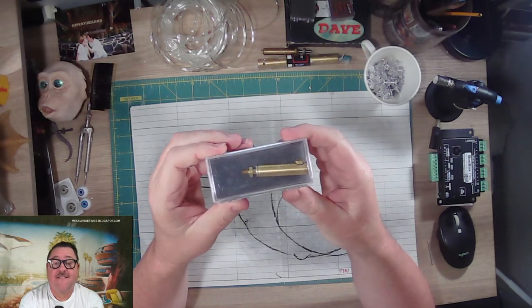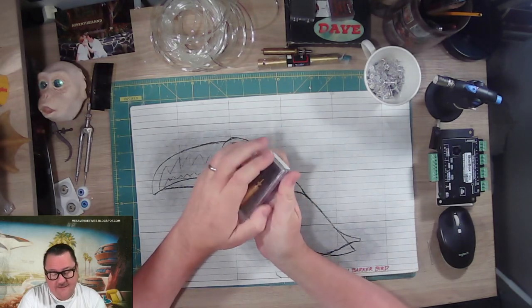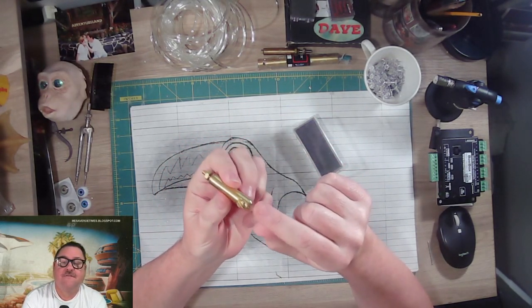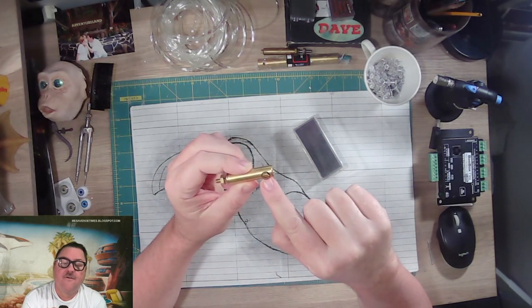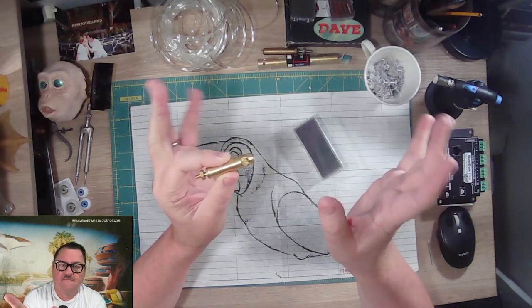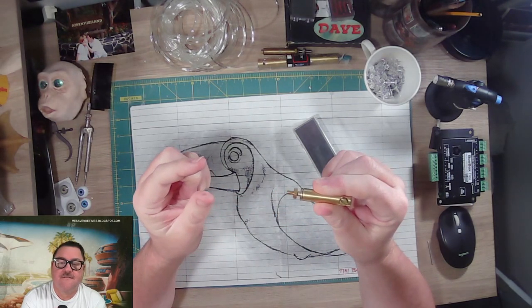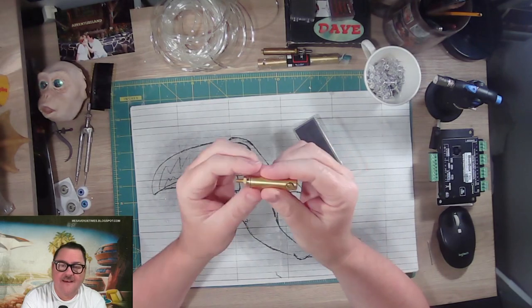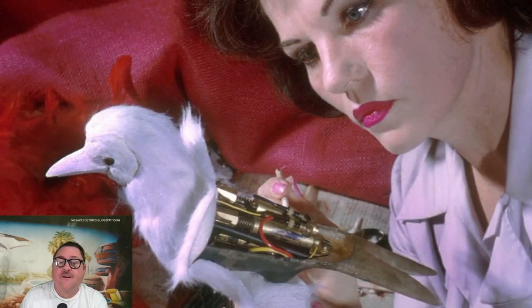This is one of the brass cylinders we were just talking about, and they're still made today — like Clippard Pneumatics. They come in a handsome little box. Basically you have two ports where you can put your air fitting — the hose goes in on the back — and the air goes in, the cylinder extends, the air goes out and it springs back in. It's a single-action cylinder. That's what you see in the pictures, almost exactly.